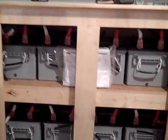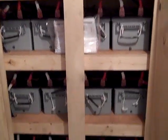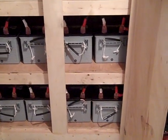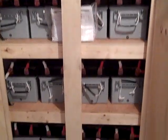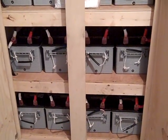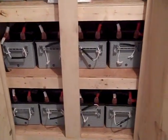Here's the bottom half. We've got AGM batteries - absorbed glass mat. A lot of you have asked questions about those. They do not need to be vented and they're maintenance free. These are absorbed glass mat 8D batteries - 8D is the size. Three strings of four in a 48 volt system. That's a 735 amp hour battery bank.